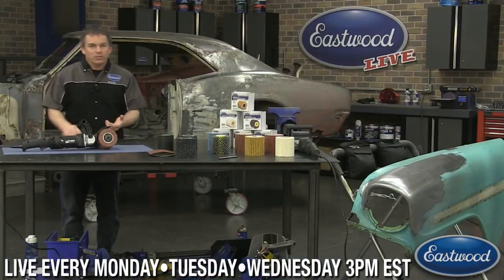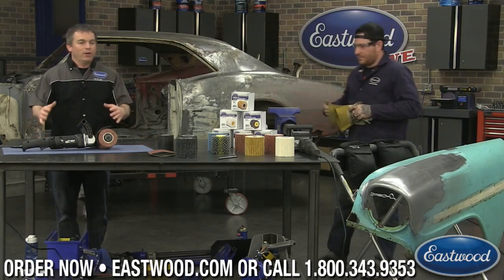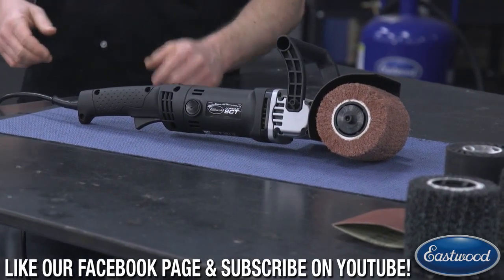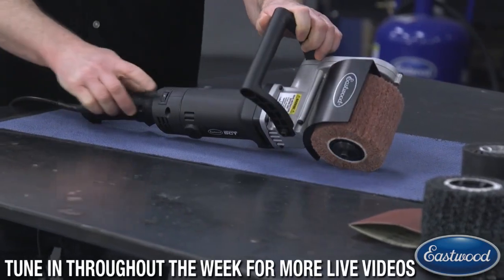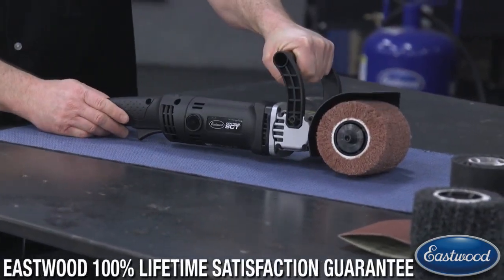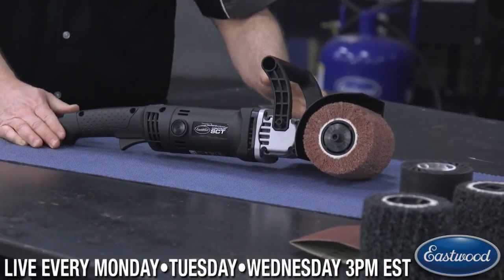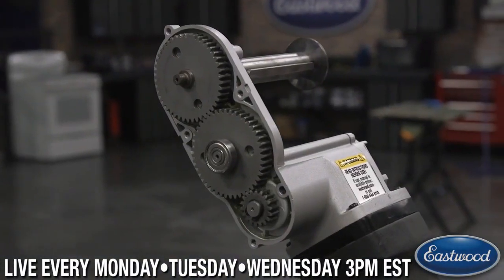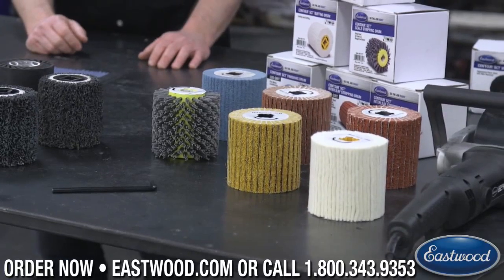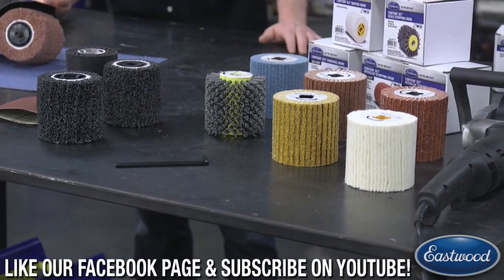If you're just joining us, you'll be able to watch us recorded on Facebook and YouTube. There are tons of videos on this awesome tool — the Contour SCT surface conditioning tool — not only on eastwood.com and the Eastwood YouTube channel, but also from guys like Empire Fab, Gene Winfield, and Mike Phillips. Quick recap: six speeds adjustable from 1,000 to 3,700 RPMs, a trigger lock so you can lock it on, ergonomic handle so you don't get torque, 9-amp industrial motor, and all-steel gears. It comes with the surface conditioning drum, but there are other drums available — the expander wheel as well as the abrasive drum. Starting possibly today or tomorrow, all kinds of other wheels and different grits of our current ones are going to be on the website.